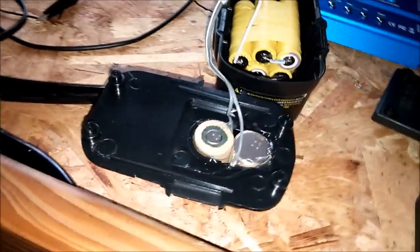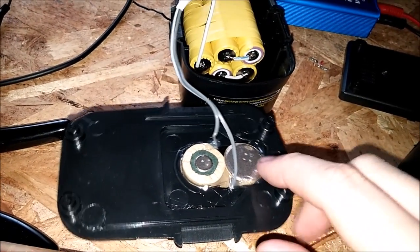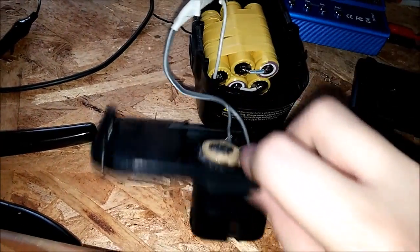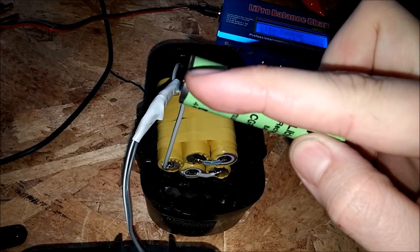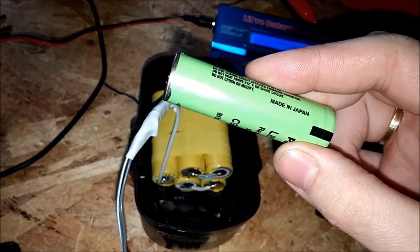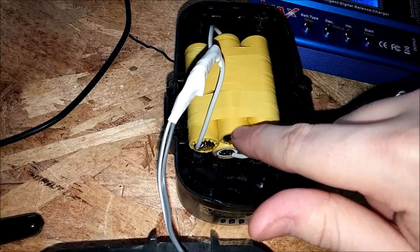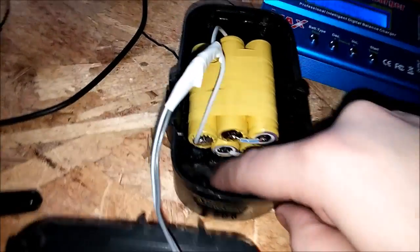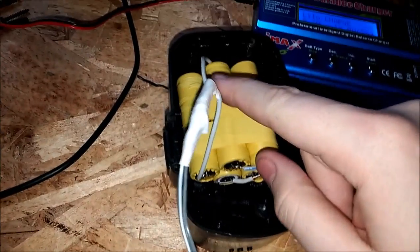These NiCad packs are not wired into the lithium ion batteries — they're just in there to hold the pins. What you want to do with these batteries is rewrap any that aren't wrapped well, using electrical tape or shrink tube, and make sure none of them touch. Then I put some hot glue in the bottom of this tray and stuck them down in there.